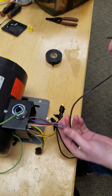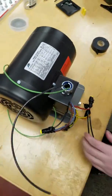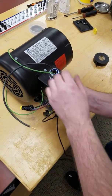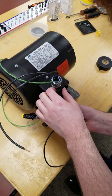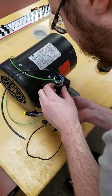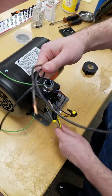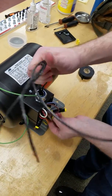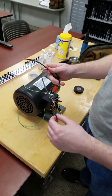Then you're just going to want to take your power cords coming out of all these and shove them up in the middle, going next to your ground. Shove them all up in there. You got them all in and you're good. You'll need to put the motor faceplate back on, but I'm not going to show that in this video. You got your wires coming out, and you're good to go for your low voltage setting on your AC motor.